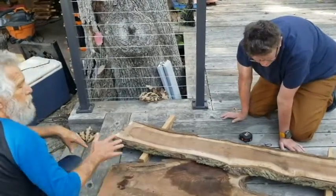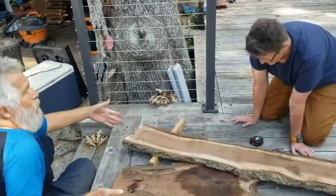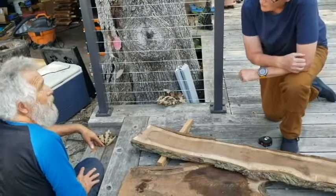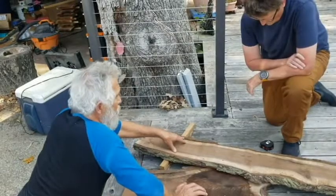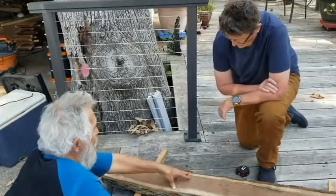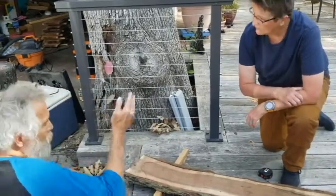So then what I would do is build up the frame, because I'll build it as a box. Basically, I'll build it up and I'll probably make it 21.5 inches wide. Because what's going to happen is when you cut this piece, these are going to stick out. And either they protrude from your dresser or you keep this exactly the 21. Exactly. That's perfect. You don't want to walk by the front of the dresser and look in the drawer.